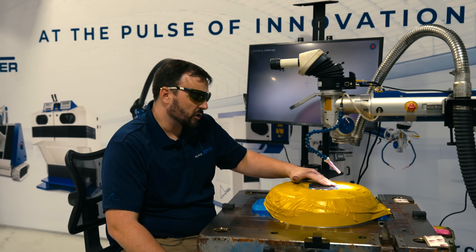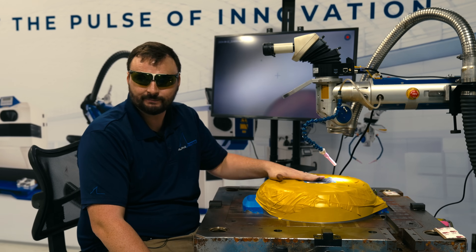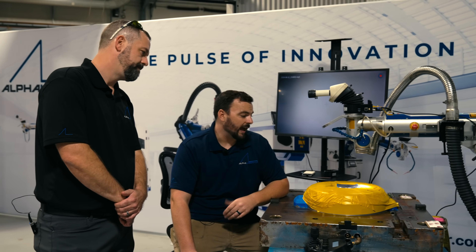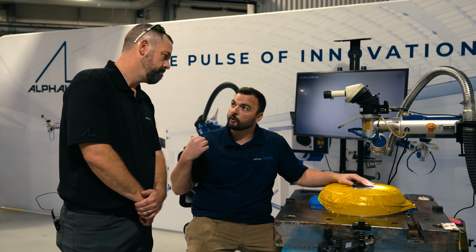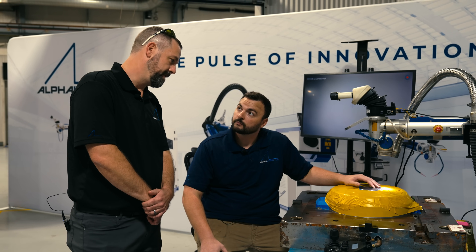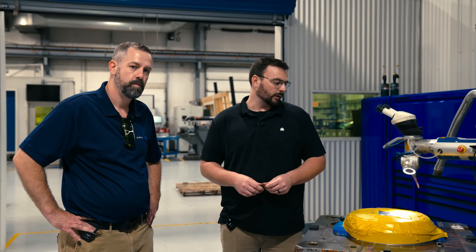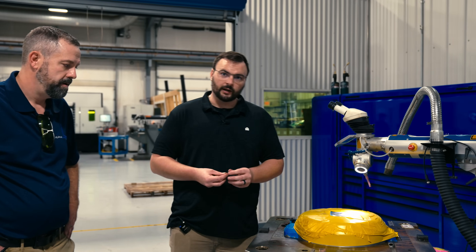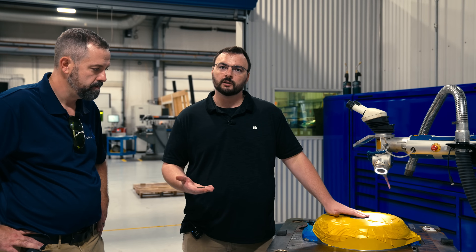You guys just saw me weld up all those pads — my hand, I can hold it right on there. That's how little heat input a laser causes. If that was TIG, good luck. Mike, are you finished? So I'm done with the laser welding portion. Tomorrow morning when I come in, I'm going to hand bench all this weld off and get it ready to go over to our engraving department. So we're actually finishing this weld job and we're going to re-engrave it also. It's the day after — we're going to come back and start benching on this laser weld. I'm going to start using a stone because we barely have like ten thousandths of material proud from the base material, so the stone should be able to knock this off pretty quick and easy.